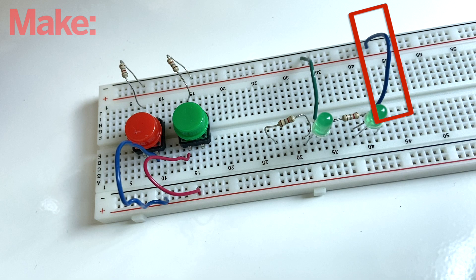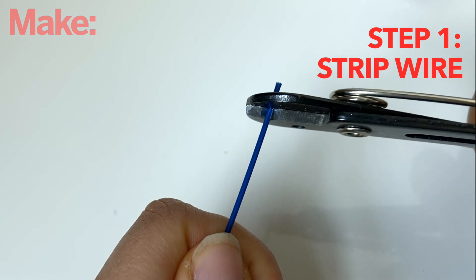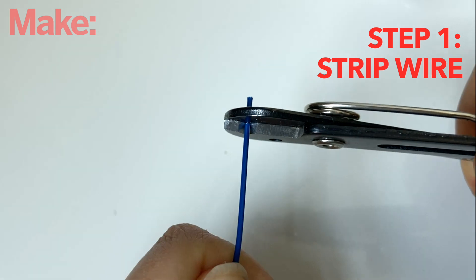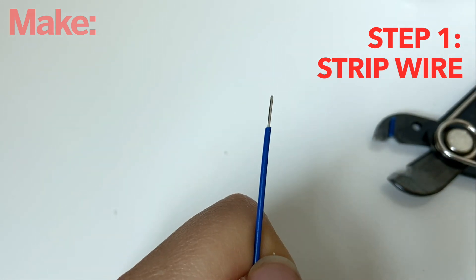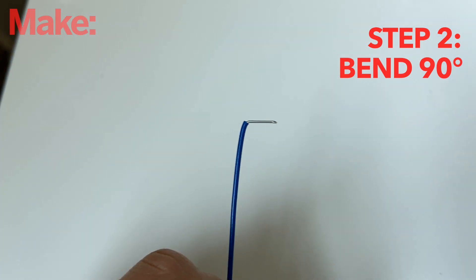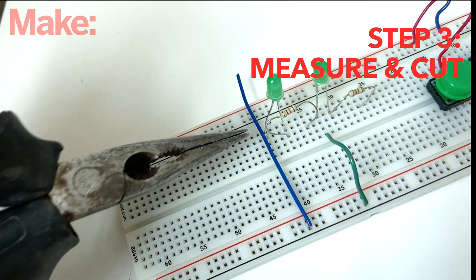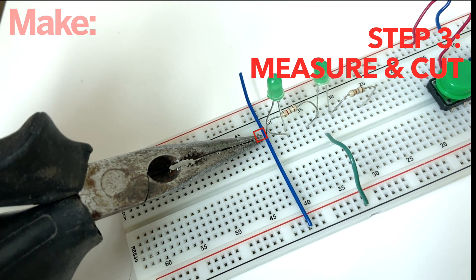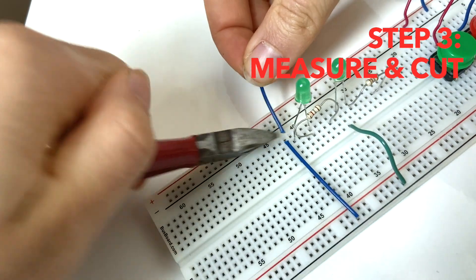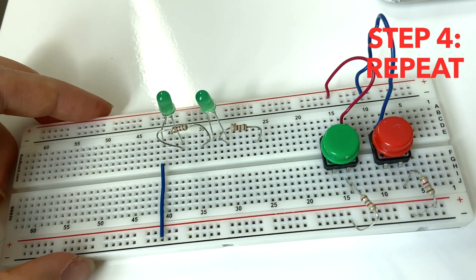Starting with this connection — to clean it up, we want something that's exactly the right length for its purpose. Step one is to strip the wire. Adjust your wire strippers to the correct gauge, then feed about a quarter of an inch of wire through the strippers. Squeeze lightly until you feel yourself cut through the insulation without nicking the wire itself, then pull. It'll take some practice, but you should eventually see a pretty clean cut. Now we're going to take our needle nose pliers and bend the exposed wire to a 90 degree angle, then insert it into the appropriate position on our breadboard. Next, we want to eyeball exactly how long the other end of our wire needs to be. Generally, the rule of thumb is you'll need another three holes past your desired location, so measure that out and cut it with your cutters. We're going to strip another quarter inch off the end of this wire we just cut, bend it to a 90 degree angle, and voila — you've cleaned up your wiring.